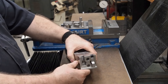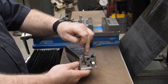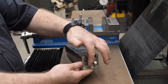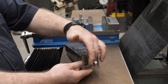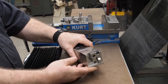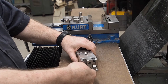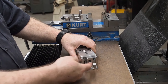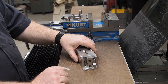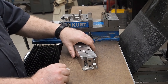The clamp head is held in with two screws. If we remove those two screws, I can turn this at 90 degrees and have my clamps going this way as well. We designed it so that you can clamp a V-block in there, and we're going to make it so you can have a clamping system that comes down at a 45-degree angle, 30, 60 — because a lot of times you get work you want to hold at those specific angles. We'll make a lot of different attachments that can go to the head.